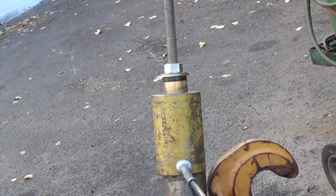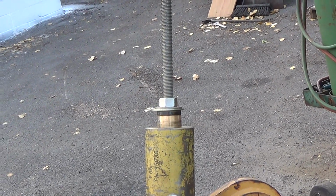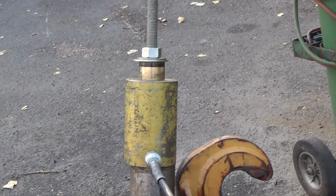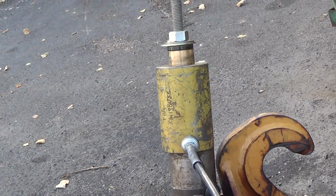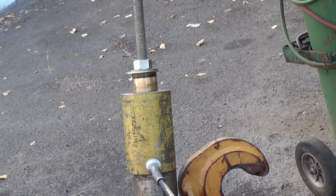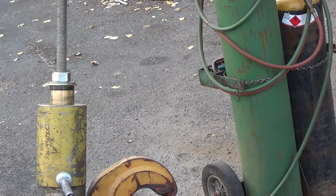Those exothermic rods now, geez, last time I bought them, I did a particularly tough stuck pin. There's not a lot of calling for it, but I want to say it was a few months ago. People know that I do it, so I get the calls. I knew it was going to be tough. A couple other people had tried it, with various mechanical devices on it. They usually come in boxes of 25, and I think I bought 2 boxes of 25. I want to say those rods are $5 a piece now, and you're gonna blow through oxygen.